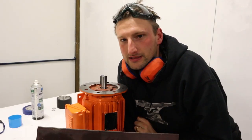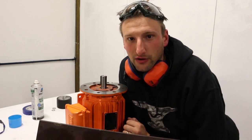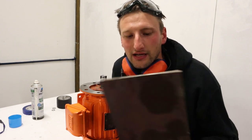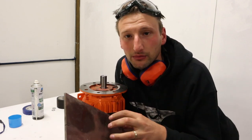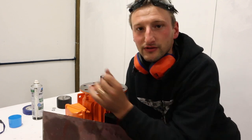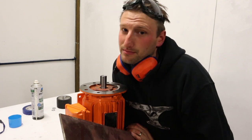Now that this motor - who I've for no reason whatsoever decided to call Ron Weasley - is cleaned off and sanded, I'll be taking this piece of six-mil plate and putting a hole in the middle so we can fit that over the shaft. Then we'll be cutting it up, measuring out the holes, and cutting it to a circle with an angle grinder, which is hardly ideal but it's the best we've got.